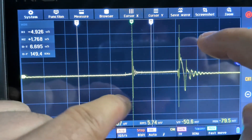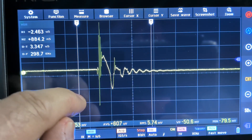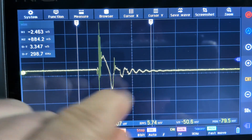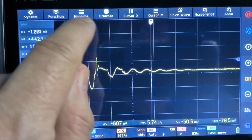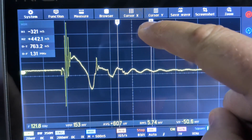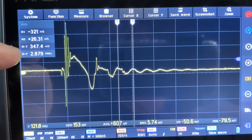These little pulses are also happening at 60 kilohertz. Let's zoom in on one of these pulses and look at that ring. Isn't that interesting — you can see it slams a pulse and then causes a little ring that fades out. If we move our cursor over and look at the cycle of that ring...